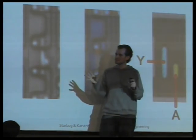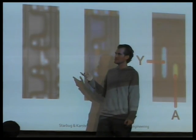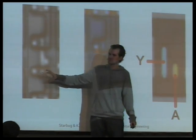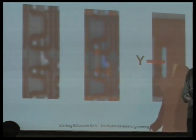Depending on the configuration, that's not always true. If you had, say, a 3 NAND, then the NMOSes would actually be larger. But because you know it's a 3 NAND, you expect that, and you can still tell which is which. Plus, they're always nicely separated. So P is always on top, and N is always below.